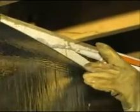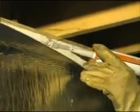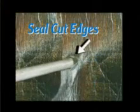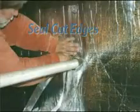Seal the entire perimeter of the crawl space by applying bonding sealant along the top edge of the wall, pressing firmly as you go. Also, seal cut edges around obstacles with bonding sealant. Finish with foil seam tape. Press the seam tape firmly to the liner.